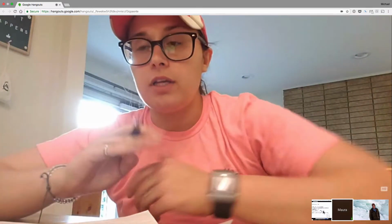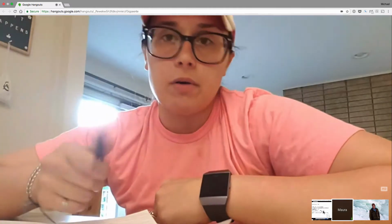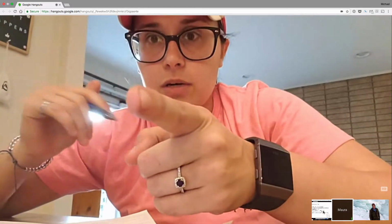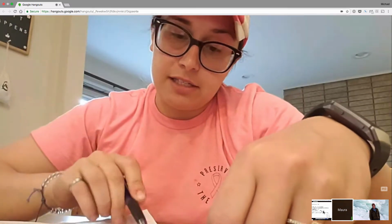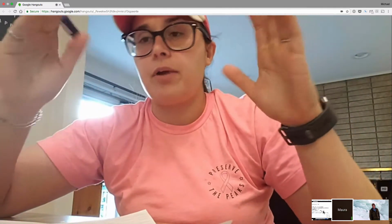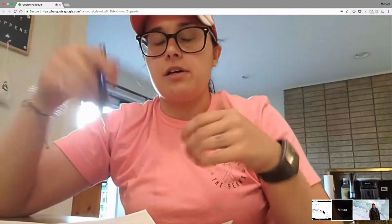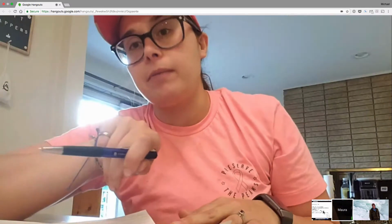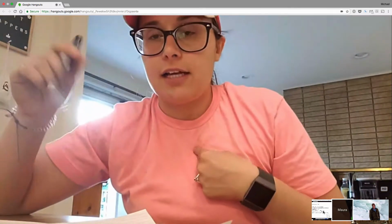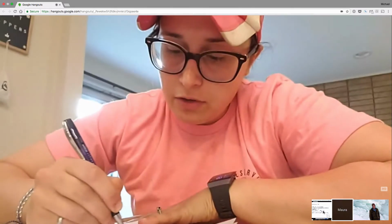So, when you get there and you need any help calculating the motion ratios because of the complex geometry problem, let me know. There is a really good site, and I don't know it off the top of my head, but if you're just looking to understand suspension parameters and what changes what, because you said you're still determining control arm size and length. Yes. And Chassis said they have their wheelbase figured out, so there's this little program that shows you a 2D view of the suspension, and you can change your rim size, your uprights, your kingpin angles, any parameter. And in 2D, you can see how that would change your roll center and your pitch center to help get a good starting point for Optimum K. Optimum K is quite a big piece of software, so when you bring it into 3D, it helps to have some 2D dimensions figured out. So I'll take that as an action item and provide you the site, if you think that would be helpful. Yeah, we'd love it. Great.